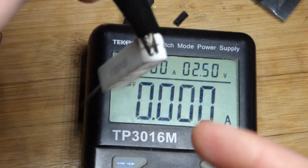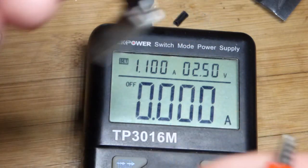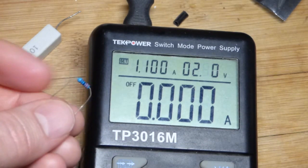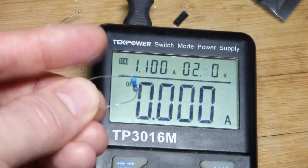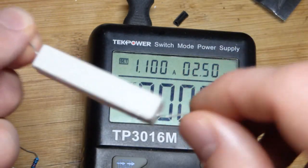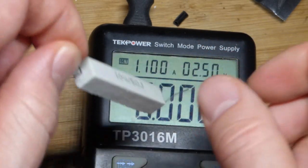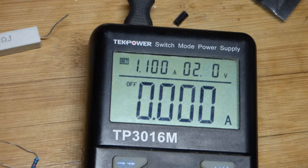There are also metal ones and stuff. The metal ones, I'm guessing, can dissipate heat even better, so they might be a little bit smaller at 10 watts. Material makes a difference, but mostly it is the size. The main takeaway is when the resistors you have can't handle the power demands — the wattage — but you really like the resistance value, say 220 ohms, and you need more current, you may grab the same resistance value but in a larger package. Then it can handle more current flowing through it without overheating. Try to stay below half of its wattage rating.